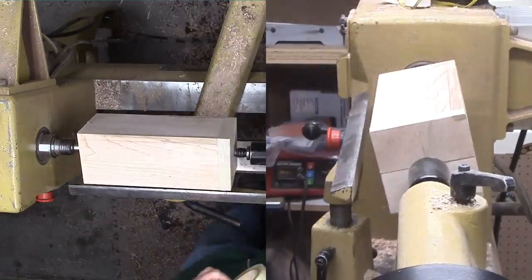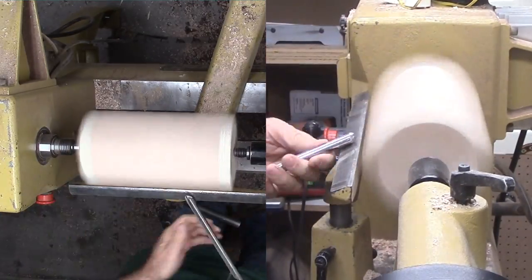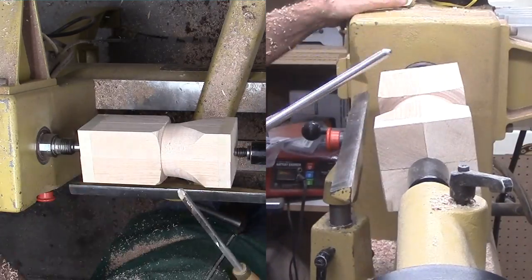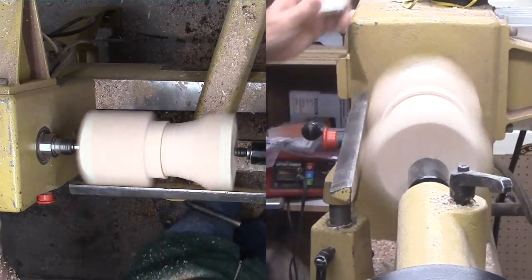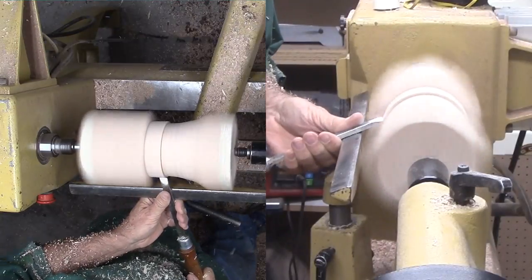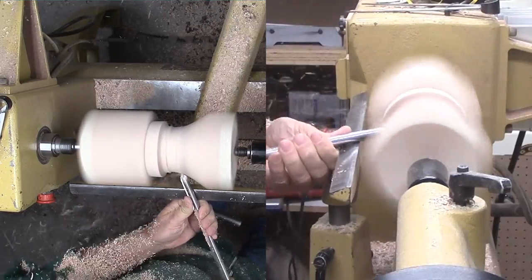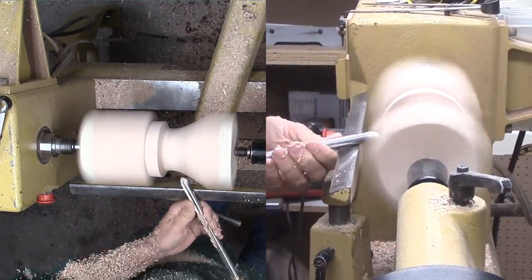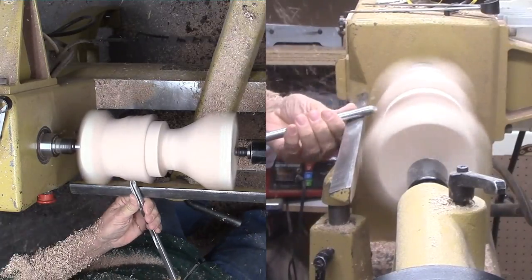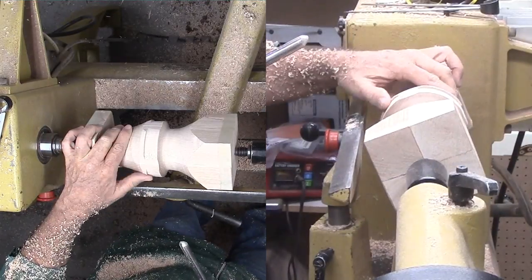Now for the first turning. This is the inside profile. Despite having turned many inside-out pieces, I still have trouble visualizing the inside profile. I think it is because I see the flat surface but the true profile is 40% different — in effect, the diagonal of the square. I'm trying for a flame portion at the top, a small portion to hold a battery operated T-Lite. This time I'm trying to leave flare strips at the bottom for an open end. We'll see how that works out.